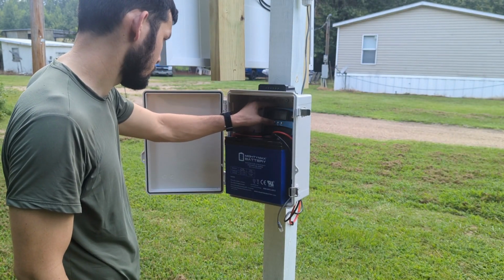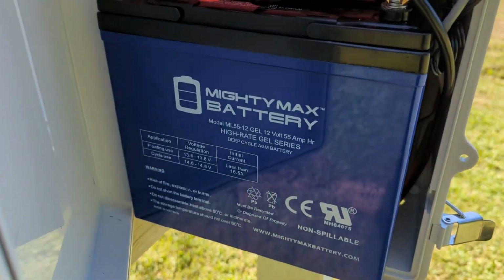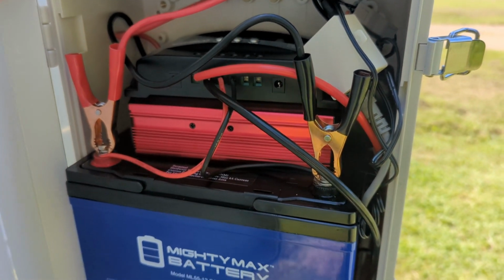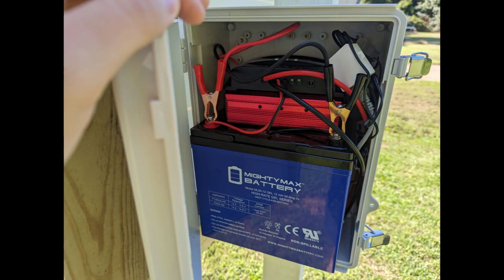And so I actually changed out the charge controller too. I changed it out from a PWM to an MPPT, which is a little more efficient. So I squeezed the max wattage from the camera, and so you're seeing me here. I'm rewiring everything and making sure everything fits, and this battery barely fit. And then later, I came back. This is not the actual new solar panel, but later I came back and got everything working. So checking that battery status is good.